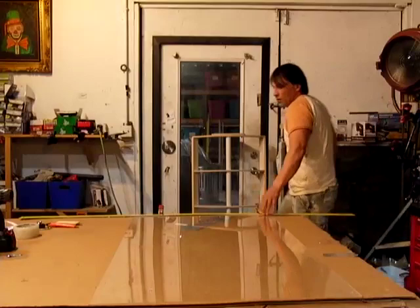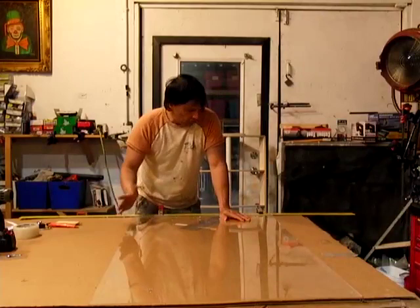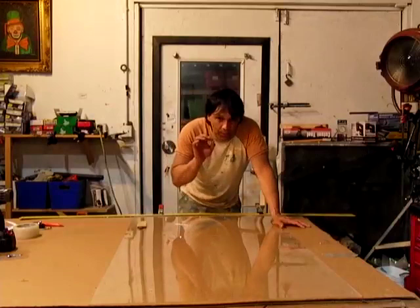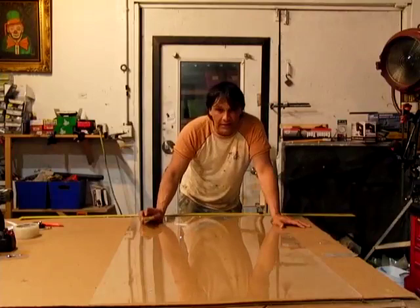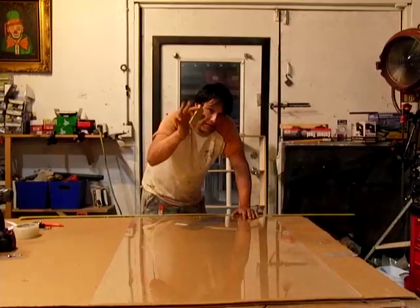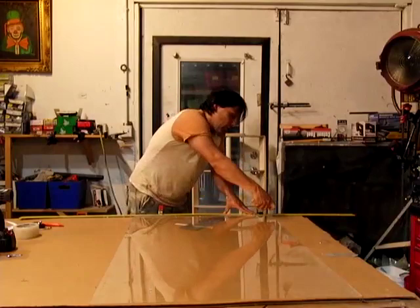You would have to drill these down to get them to lock into place. I've got myself a piece of 50-inch acrylic that's more than what we need, so we need to cut this down. There are a lot of ways of cutting acrylic — you can run it through your saw a few times raising the blade a little bit each time, or take your saw blade off, flip it around and run your acrylic through, or buy a proper saw blade. Easiest method though is this little acrylic cutter device I made that I'm probably going to have on our website.